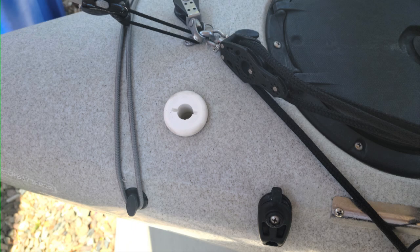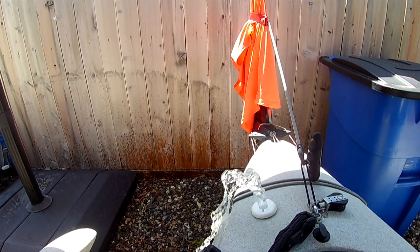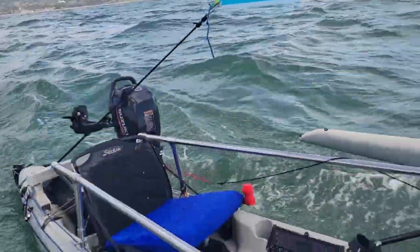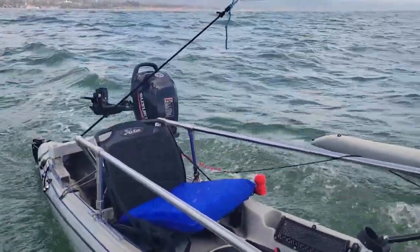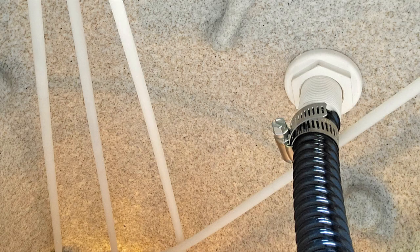As far as discharge, I elected to discharge the pump just behind the rear hatch as shown here. Based on my observations while sitting out on the amas, that part of the boat is rarely submerged, but even if it is, the pump is built with an internal backflow preventer. The nice thing about discharging at this location is I was able to use only eight inches of three-quarter-inch discharge hose, so I have very little head loss.